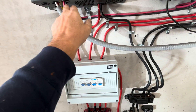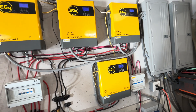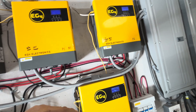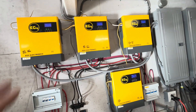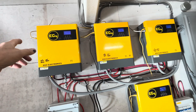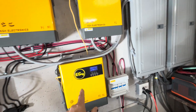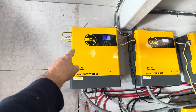These are almost plug-and-play: two battery wires, two solar wires, two output wires, and a ground — that's it. The communication cables are included. I used a white cable and a black cable so viewers can trace them in the video. On four of them it goes in a full loop — white goes from the first inverter into the second, out into the third, and then the black comes back into the first, completing the loop.